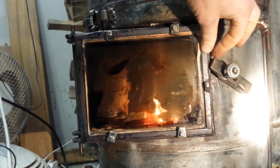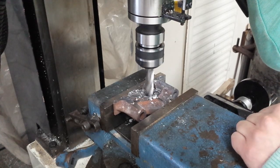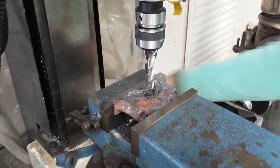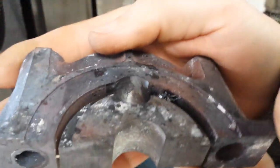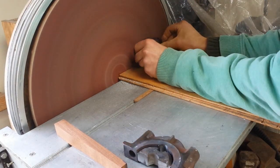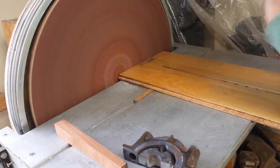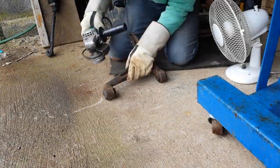To get over this, I'm putting them in the stove and leaving them for a nice continuous burn. Well, what do you know, that actually worked. It's not the best hole, but it's still a hole. After being annealed in the fire, they're quite crummy, so we're just tidying up the surfaces, making bits bright and shiny on this sander. The 60 grit sandpaper does a really good job at this.